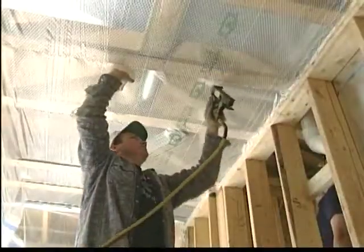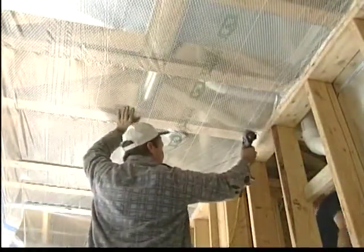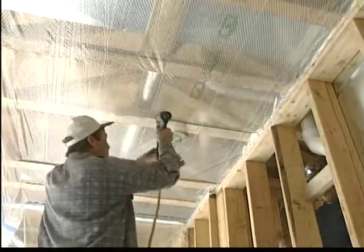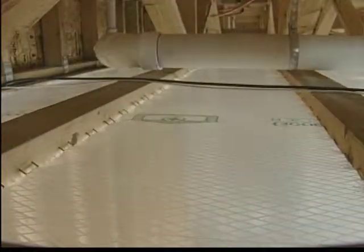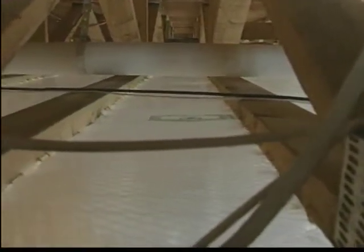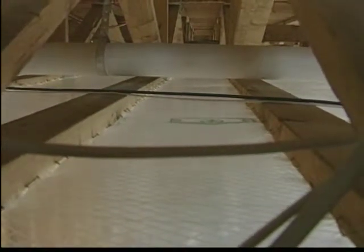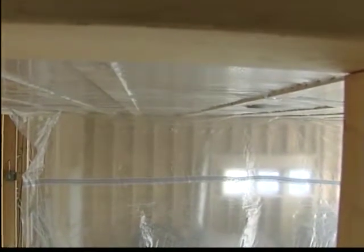The poly is lip-stitched onto the ceiling. The entire cavity above the engineered trusses will be blown with cellulose fiber insulation, not dense packed, but blown to the full height of the cavity. This is a specification from the utility company that we complied with. Plumbing pipes, electrical wiring, all of this will be encapsulated right up to the raised plywood surface above the ceiling. There's living area above this area, and all sound will be eliminated.